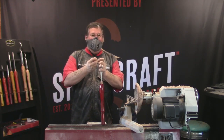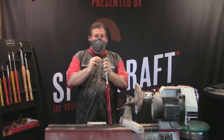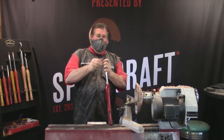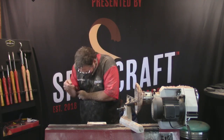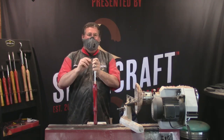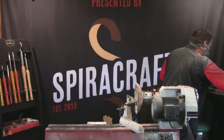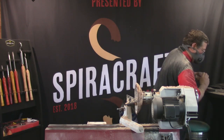And we know that the maple wasn't really hard, it was really soft. I mean, that's beautiful colors in there. And so, worry not that the natural colors are going to go away, because even though I'm going to soak or submerge this guy in resin, I don't want to spend the time mixing the gel and poking it in each hole. Dropped my wrench into the sawdust. We'll turn all the resin away except for what's in the voids. So it will be right there. All the black and all the striations that you see in that wood now will be back, but these holes will be filled. And my initial thought, I brought black and some gold kind of colors to work with. So I think that's what we'll work with today for this.